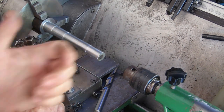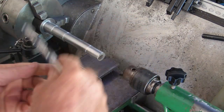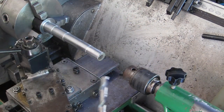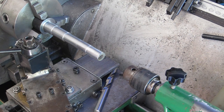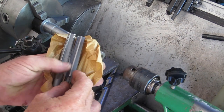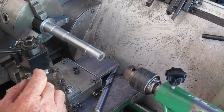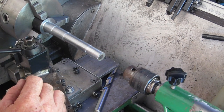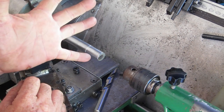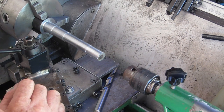So that's the state of play. If you've enjoyed this whole thing, give it a big thumbs up, and if you haven't yet subscribed, consider subscribing. There's still a fair bit to do — I need to drill a great big hole up in there, flip it around and drill again, and I've got these two Morse taper reamers I bought to try and ream that. After spending this much time on it I don't want to wreck it, so before I do it on this one I'll make a sample piece first. It's Friday and we're around 20 minutes in, so that will be in part five — make sure you come back next week!